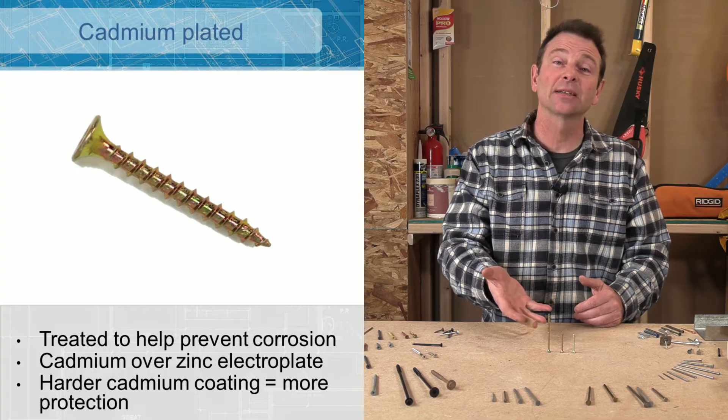My last example is drywall attached to framing. Here I have an inch and five-eighths drywall screw, and typical installation for drywall requires you to sink the head a little bit, which adds to the depth that fastener will penetrate our base material. You can see I have plenty of room — even if I sink that screw a little bit into the surface of the drywall, it's not going to come out of the back of that material. If I used a longer screw, say a two-inch screw, and I sunk that a little bit, we're going to send that screw through the back of this material. Remember that point's very sharp, and anything in the way could be a real problem or a hazard.